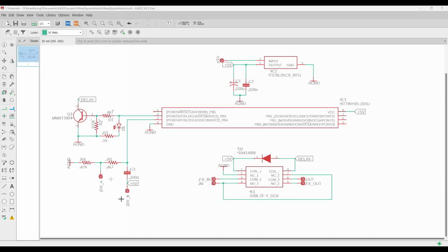Now, this looks like a little bit of a complicated setup, but the way that it works is this. There's always power on this side of the switch, but this capacitor is blocking it, so that this pin, when the button is not pressed, all it sees is an equivalent 50K ohms, about 51.7K ohms to ground. So that's going to make sure that the voltage is pulled down on the pin. So the pin is going to be low whenever our button is not pressed.